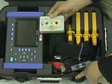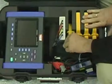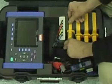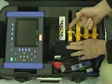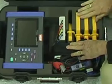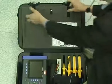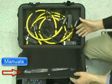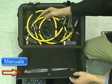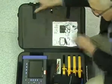We've got the power adapter to allow wiring for Delta systems. We've got a 200 amp, 20 amp AC-DC clamp. That can be used on the neutral, or alternatively could be used, for example, if you're looking at rooftop solar systems. We've got three 1000 amp fixed clamps as well, and we've also got four flexible clamps — these are the 500, 5000 amp clamps. So there's a complete range of clamps as you may need them.